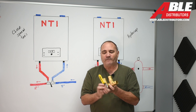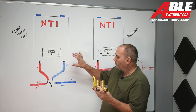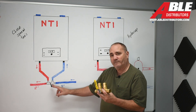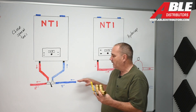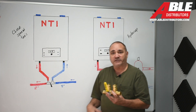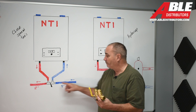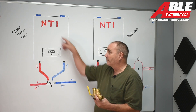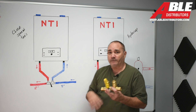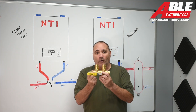The beauty is it's got a valve in between. So what that allows you to do is when these pumps are running, you can close that valve in between the two T's and then you can purge out all the air from the whole system faster and easier than having some of the air bubbles just skate through and not go through the boiler. So what you do is bleed out the air of your whole system with this valve closed. Once you've got all the air out, you open the valve.